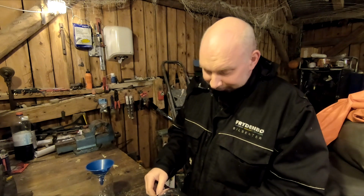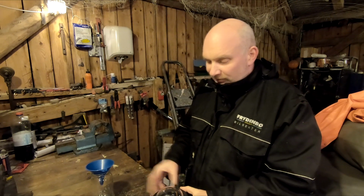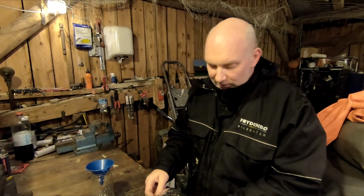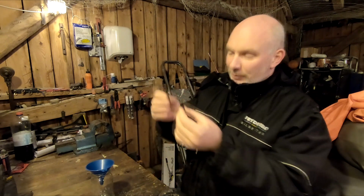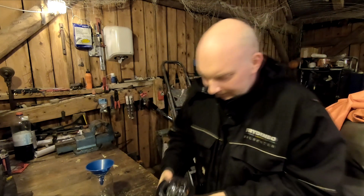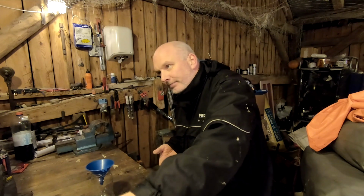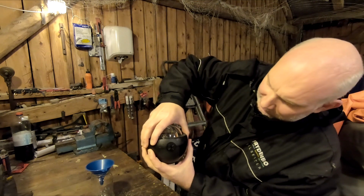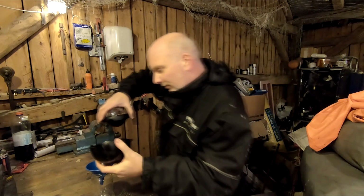So what I did, I took the compass off its mounts in the boat. I removed the flip screen that you can put over it. To remove it from the mount, I took out these two bolts that sit in this point of the compass on each side and hold the whole unit to its mounts. And when you remove the screws, then you can take the lower bowl of the compass off.